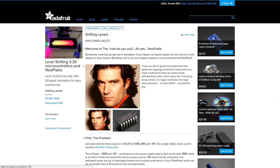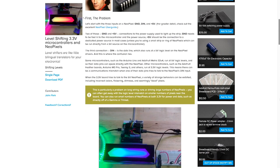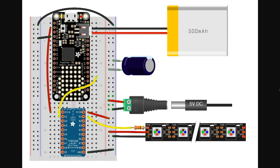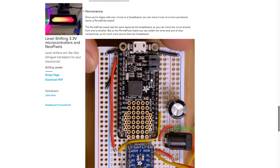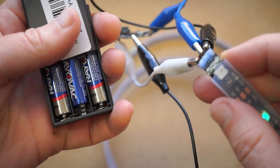While hooking up these LEDs and figuring out the right way to power both the boards and the lights, I took a moment to re-familiarize myself with John Park's guide on level shifting. The best way to get a 3.3V board to talk to a 5V LED strip is to shift up the voltage on the data pin to match the LEDs. John's guide on Adafruit shows how to accomplish this with an 8-channel logic shifter board. As an alternative, for the Kitty I just wound up running both the board and LEDs at around 4V, and they seem happy for now.